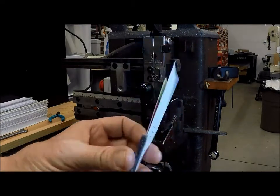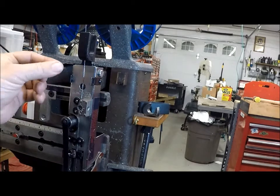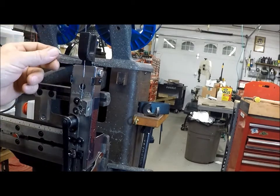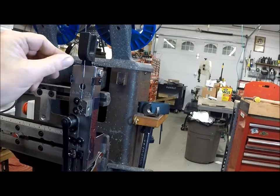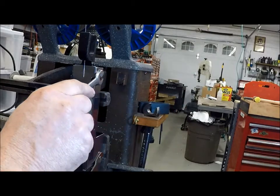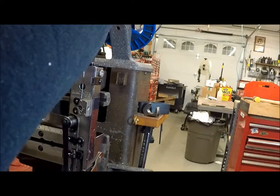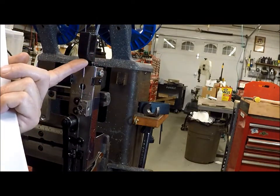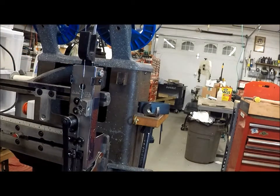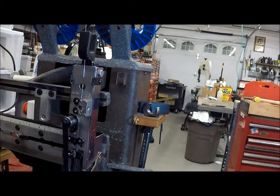Now I'm going to work with the left leg adjustment. There's a little set screw right here in the casting. There are different styles of this adjustment, but this is the most common. You loosen that little set screw, which allows you to turn the adjustment screw behind here. I like using a wrench instead of a screwdriver, especially if there are two heads next to each other. Crack this loose, make your adjustment. Turning the screw clockwise will raise this casting — you might see it going up — and that will shorten the leg. Let's do a couple staples and see what happens.